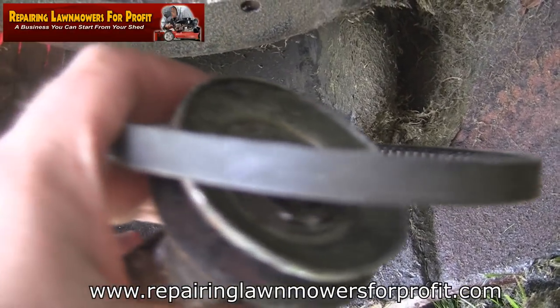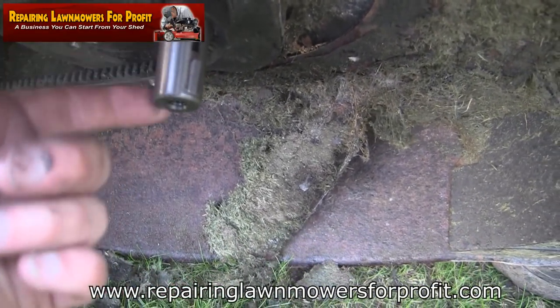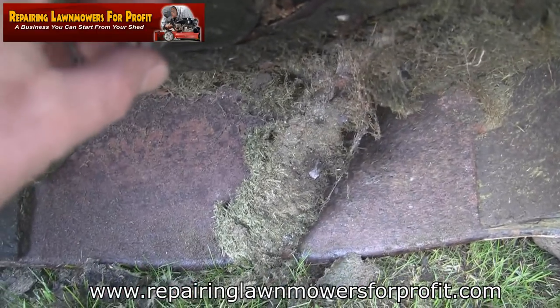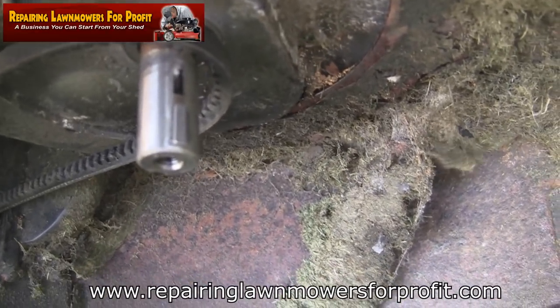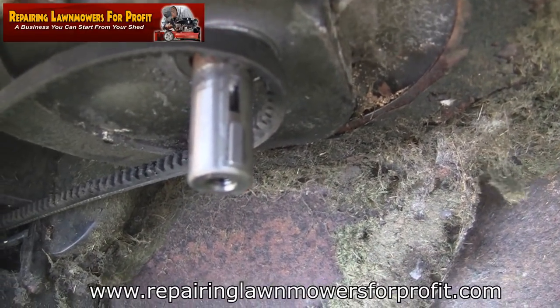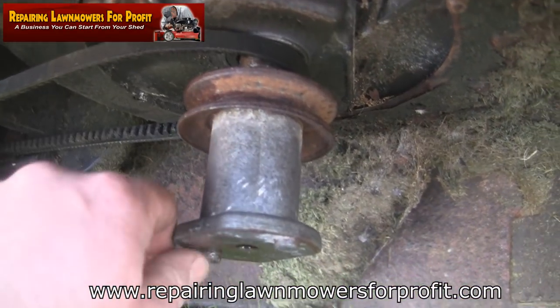It's just a little bit fiddly but just get everything lined up and get the belt on at the back - it shouldn't be too big a job. So I'll just pop our new keyway in here. It's actually a full-length shaft on the other side - I don't want to go in there, I want to go in this side. It sits in that one - yeah, this just sits in the bottom. Then I'm going to push this blade adapter just in, line everything up. You can see I've just pushed it on the shaft, just tapped it up from the bottom.